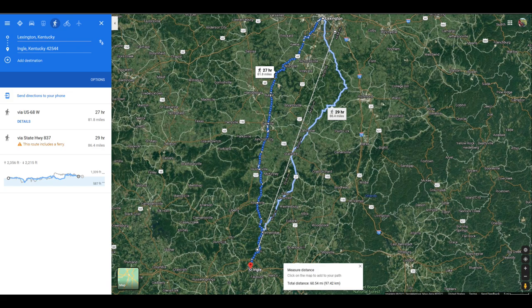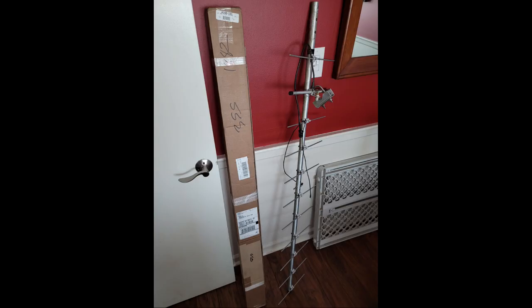What I have been discovering — and we've had a series of videos that sort of talked about this — it's pretty good distance. I had a copper J-pole. I could occasionally hear the repeater down there, but it was very difficult, and usually impossible, to really talk on it. Moved to a three-element Yagi — things got better, not great, but they got better. Got it up a little higher. Six-element Yagi was pretty good until this construction started. So the 10-element, I think, is really going to be a big help. And as we'll see towards the end of the video with the testing, and the short period of time I've used it so far, it's working much, much better.